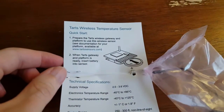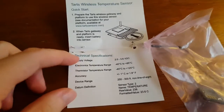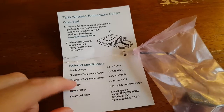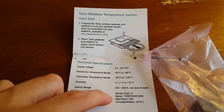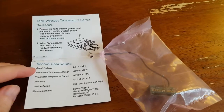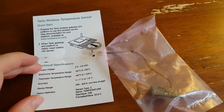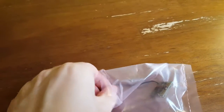On the inside of the packaging, like with all the Tarts sensors, they put a little information about the sensor and how you can connect it up and how to put the battery in to power it. We have a little bit more about the tech specs — the range of the wireless transmitter, and it confirms we're using a thermistor. It's going to give us a raw value and also a formatted value, so it must have a lookup chart. Normally with a thermistor you take the analog value and convert it using a chart to an actual temperature — maybe they're embedding this on the board or in a library for their gateway.